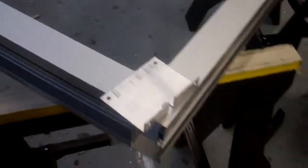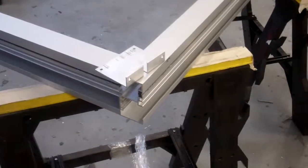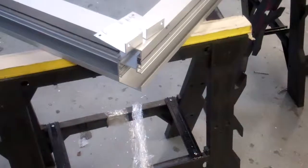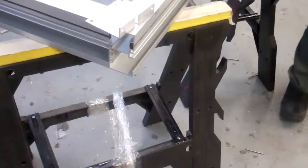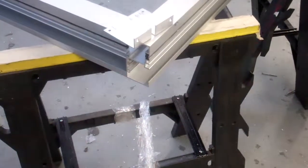It is recommended that a field test be done by pouring a small cup of water at the corners and tilting the frame once the silicone is dry, to confirm that no water gets through the corners. When everything is ready, we will go to the next video to show you how to actually load the frame into the opening using the sill channel and the head channel.